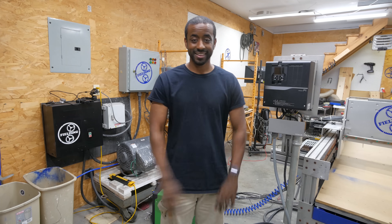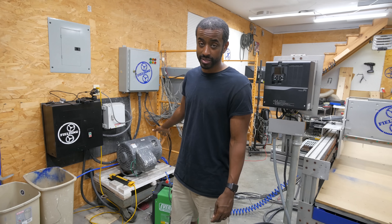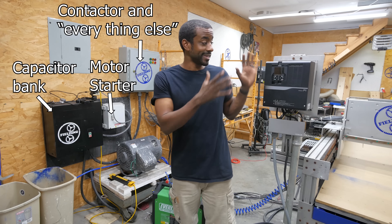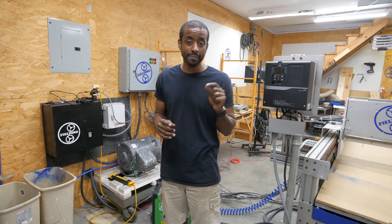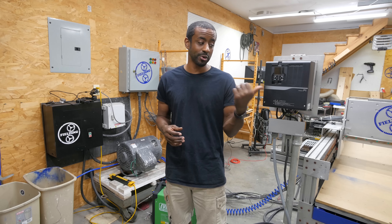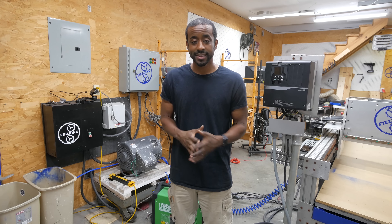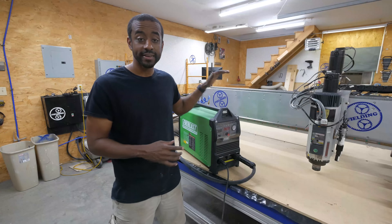To get 15 horsepower worth of three-phase power into my VFD, I have all of this over here. This guy down here is a 30 horsepower motor that I'm using specifically for creating three-phase power with my rotary phase converter system. My system is so large that I need such a large motor, but you may not need a setup like that — in fact you may be able to go from single phase to three phase inside your VFD. I've made a whole video about how to do that, and I'll put a link in the description. This is mainly a problem here in the United States; in some other countries you have three-phase power right at the wall.